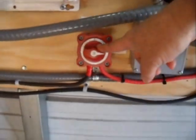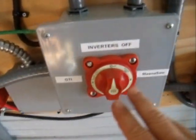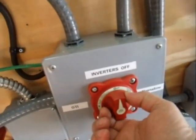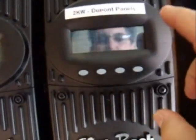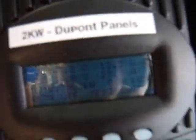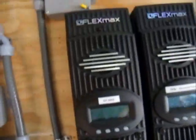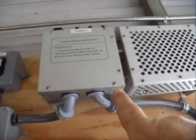The power from those batteries comes in through these cables, goes through my battery disconnect switch, and then I can manually switch whether or not I want to feed power to the MagnaSine inverter or out to the grid. I'm going to automate this. What I just did today is I reset my voltage so that when it's charging in bulk charge — as it is right now — the 24-volt battery bank voltage when it's full will be higher than the dump load settings on these charge controllers for my wind generators.